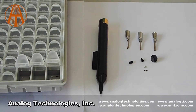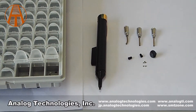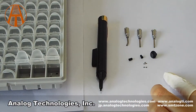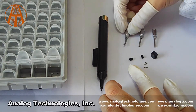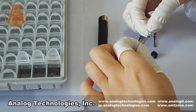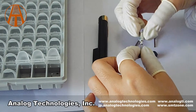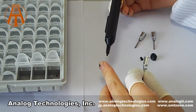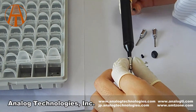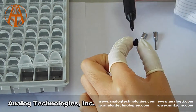Firstly, I prepared three cans of resistor chips for operation. I need to place these miniature suction cups on the tip of the probe. Then put the probe securely on the tip of the LP-200 tool. Make sure that there is no dust on the rubber vacuum tip. Note: our larger rubber vacuum cups can be placed directly on the LP-200 tip without using a probe.